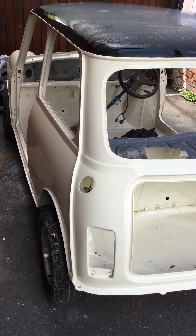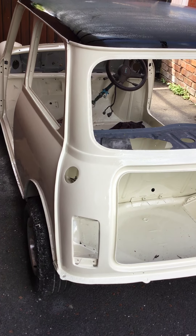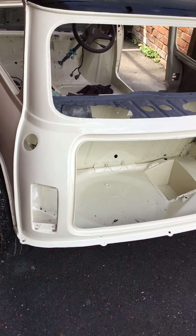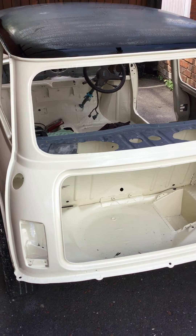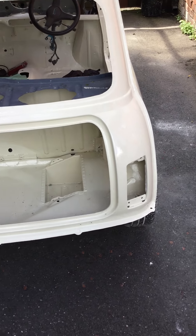It's only the second coat on the bottom of the roller. You've got a fine brush — 4 inch, 3 and 4 inch brush. A tipping brush is the best thing, which I bought — I think it was £6, £7. Well worth the money, very good thing. It doesn't hold paint, all it does is spread the paint. I think it gets all the air bubbles out.